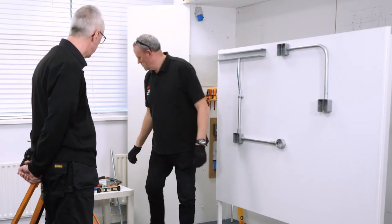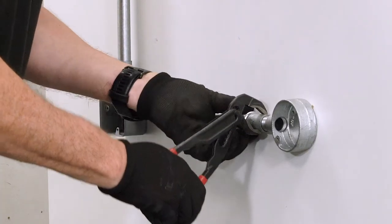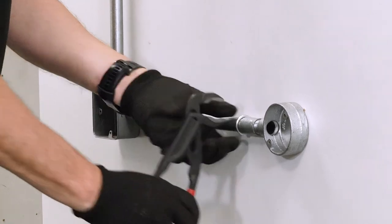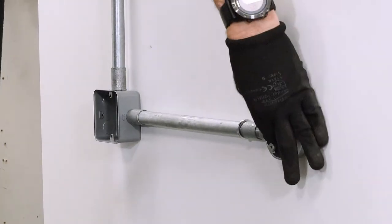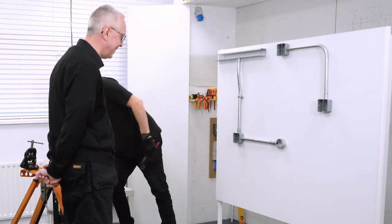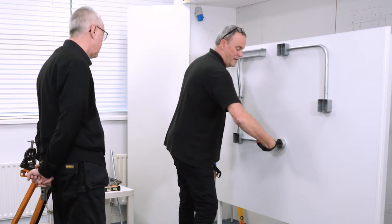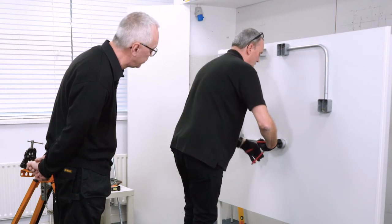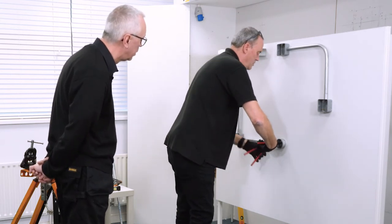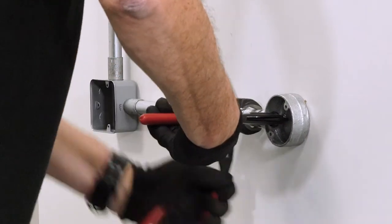Sometimes there may be a slight disparity, so I'm just going to use the gland pliers and run it on to the coupling. You may find that the nipple starts to turn — you may be able to get around it by putting your finger in there and holding it, with your gloves on of course. You can also hold it with another pair of grips. This is why it's very important that when you thread conduit, you keep it straight — because if you don't, these do not run on true.